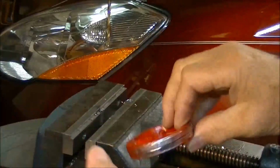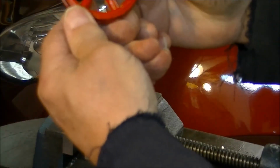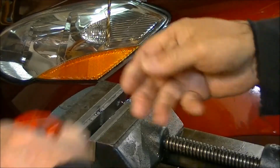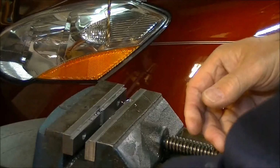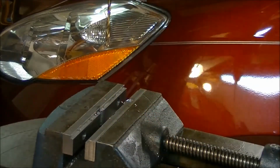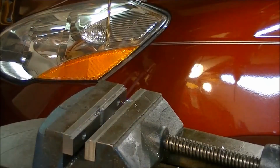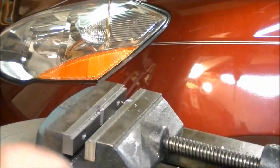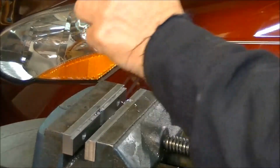Okay, had one try to sneak off there. But as you can see, most of them, the spokes are perfect, the wheels are perfect. This is a really nice looking one, and the best looking ones were done when the mold got cold while I was drilling bigger holes in the top of it. The first 2 I did after that came out better than any of them had. So that was encouraging. So I guess now we get down to the reaming part.